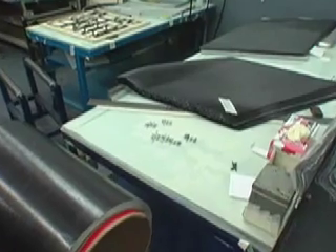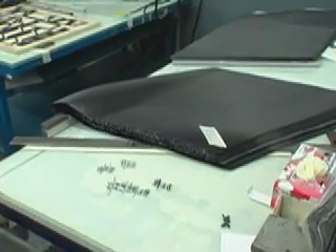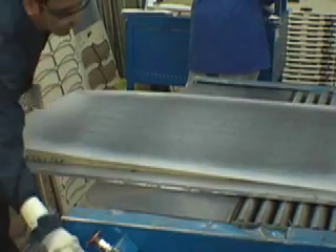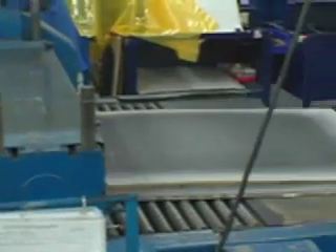After the materials have thawed and are ready for manufacturing, they go into a cutting phase. What you're looking at are graphite materials that have been cut at 45-degree angles and will be sandwiched together through an ironing process and put through various phases of manufacturing prep. This, for instance, is a die-cutting machine. You see elements coming out here that will be used for reinforcement of a variety of products.